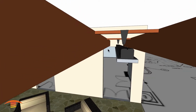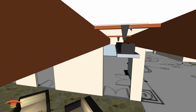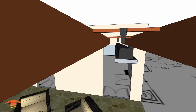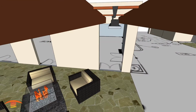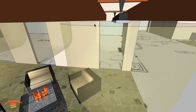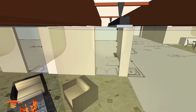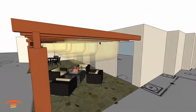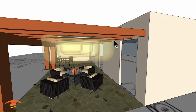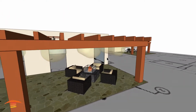So if you really wanted to reduce that so that it's at the same elevation as the bottom of the beams, you'd have to modify this some other way. Maybe cut the top off and put a couple screws in on the left, or on the edges, as opposed to the top here. All right. But the one thing you do not want to do is reduce the clearances or not meet the clearances to the combustibles below the unit. So the bottom of the heater has to be no higher than the bottom elevation of the beam itself. And you can see here we're meeting all the clearances. The bottom of the heater is 18 inches on all 4 sides, and then 36 inches below. All right. So that's these 3 units here.